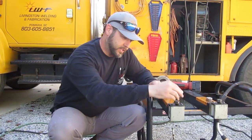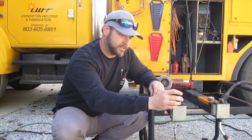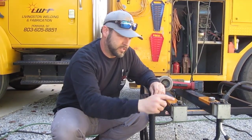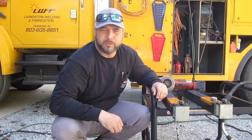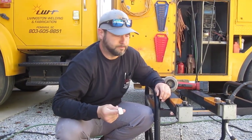Also I'm just going to kind of stick it on there, that way if this nut does wear out, it's no problem to just whack it off and stick another one right back on top of it. Kind of easy peasy. So I'm just going to take the grinder, clean up the tops of them a little bit, and stick them on there, and I'm going to start zapping them and keeping them cool as I go. So hope you enjoy it. Come along with me. Here we go, guys.